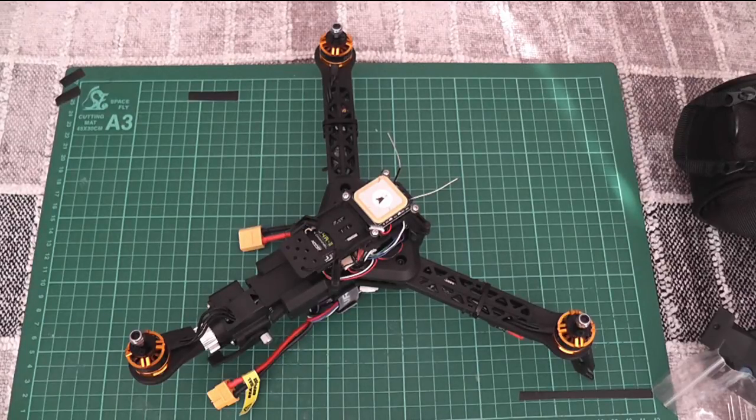For configuring the gyros on the flight controller board, I used the method used by Painless360, using standoffs, and that seemed to work quite well. However, when I mounted it into the frame, Mission Planner complained about barometric GPS differences and insisted that I reconfigure it. So I had to do the gyro calibration with everything wired in and mounted in the frame.